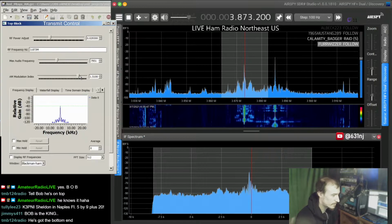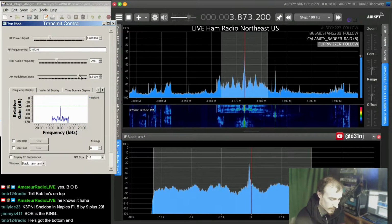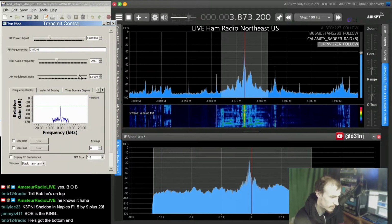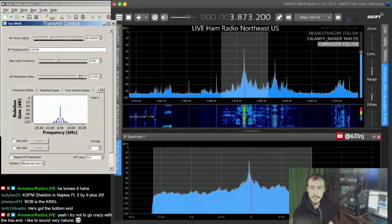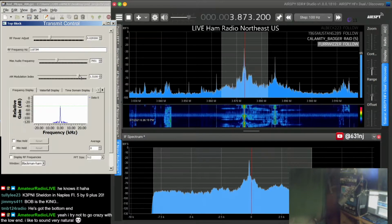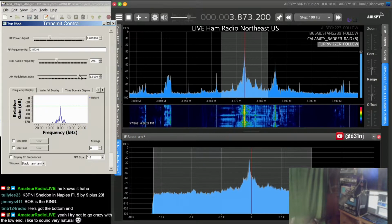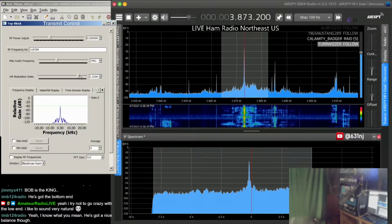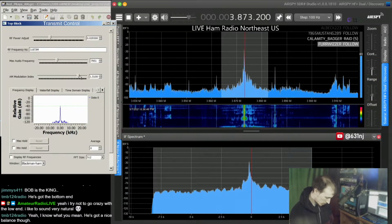Hey, I heard Steve on today running AM linear with a MOSFET linear he built, a 10 pill MOSFET linear. Yeah, he's getting about 200 watts carrier, 175% positive peaks, and I said, you gotta put some more FETs in these. Yeah, I think I'm gonna go to 12 because I want to get it up around 400 watts carrier output. So that's great. Yeah, 80 volts I think he's running it at, using the FQA 11N90s, which are about $3 a piece. They're fairly cheap. So it's for the guys running the Anans and the Flex 5000s, and instead of running them barefoot at 25 watts on AM, he's come up with this amplifier so it'll be right up to around legal limit running the Flex, because the Flex's sound is pretty much as good as the E-rigs. So I think that'd be a good seller.